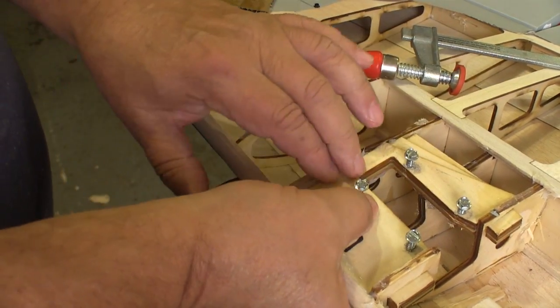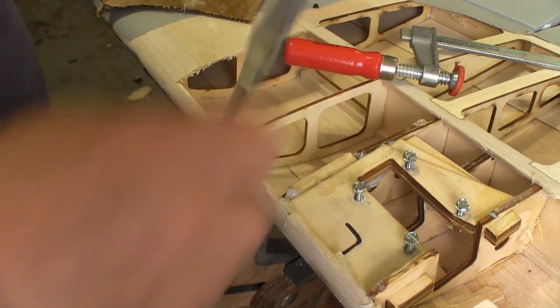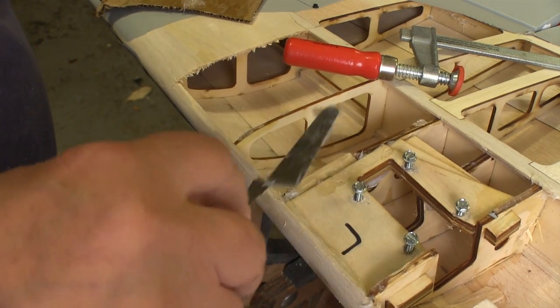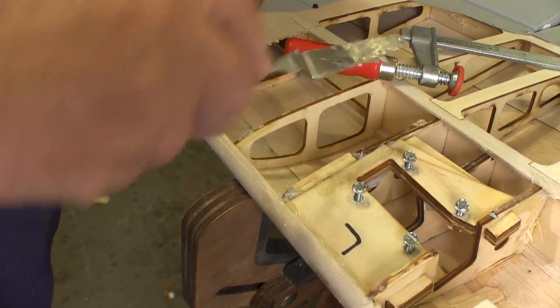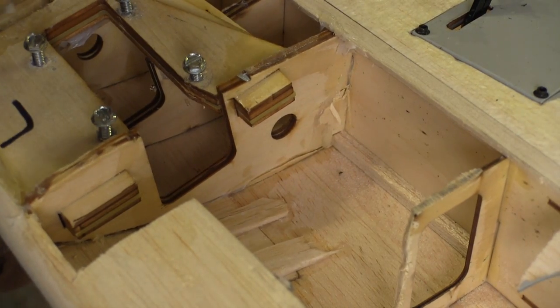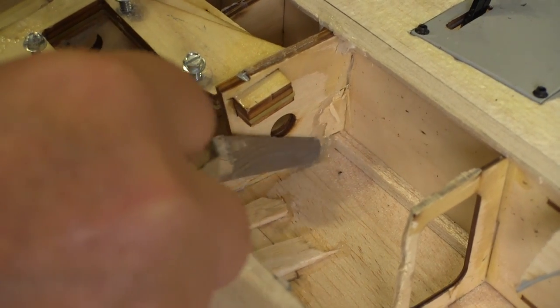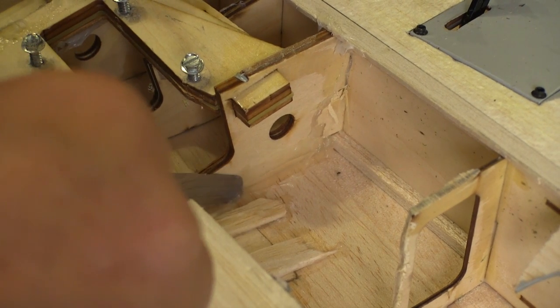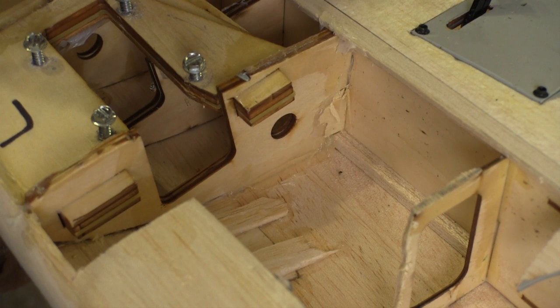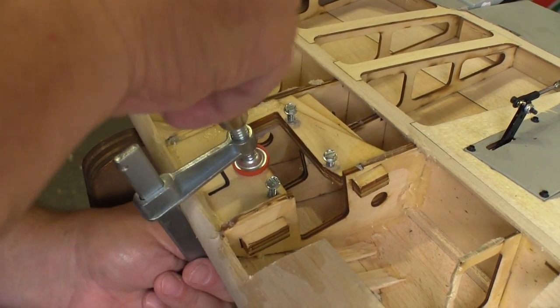After the part is placed the way you want it, the palette knife comes in handy for removing excess glue that may squeeze out. But with a high stress application like this I'm going to use that extra glue for something — the tip of the palette knife works great for making a little fillet along the joint line. That lets me add a little reinforcement to the joint without adding a lot of weight. And because the EpoGrip Epoxy doesn't run, it stays just like I left it while it's curing. Like I did with the other side, I'll add just a little bit of clamping pressure to hold the joint closed.